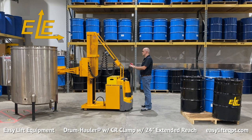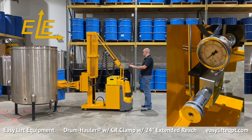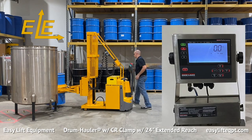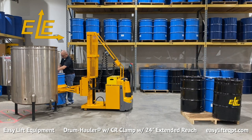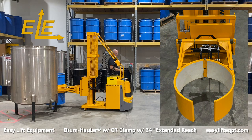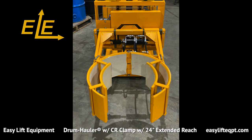Popular additional options for this model include a small drum adapter, adjustable clamping pressure, optional scale systems for intrinsically safe and non-intrinsically safe areas, and an electrically enclosed EE rating for hazardous areas. The clamping pads are comprised of SBR rubber to provide a durable yet secure non-marking surface to grip the drum. The small drum adapter, which allows for gripping smaller drums down to 14 inches in diameter, is comprised of two individual curved sections with white non-marking rubber vulcanized to the metal curves.